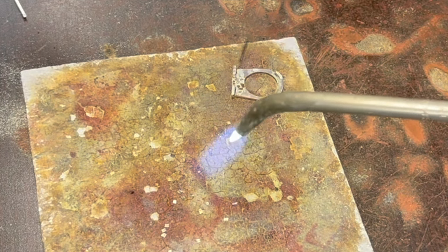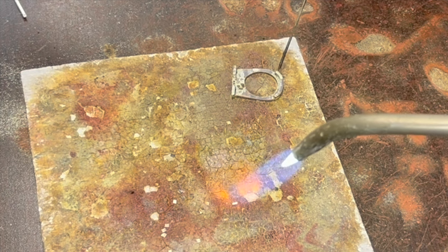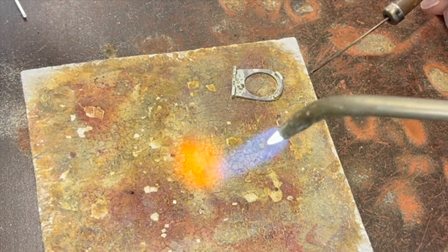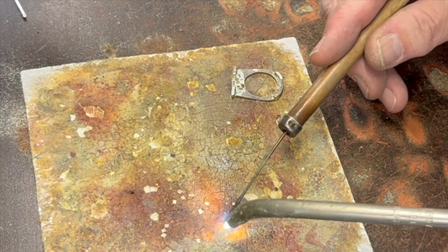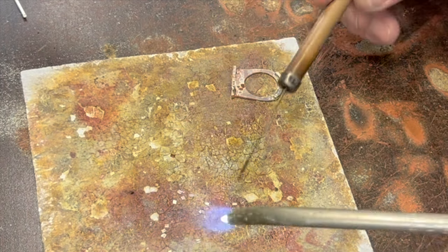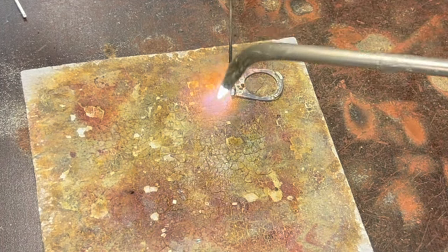What I'm going to do now is called sweat soldering. I'm going to pre-melt a little bit of solder on the upper part of these ones that I just put on, so that I'll just be able to set that one down on top of it and reheat it till it flows. And go on top of it. Get it spread out a little bit. And here.